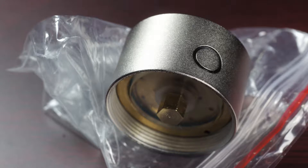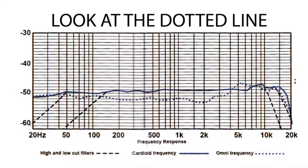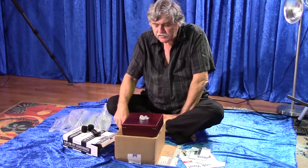This is an omnidirectional capsule. That's kind of interesting. When I first looked at the specs on this, I had a real WTF moment — because if you look at the frequency response, there is an extremely exaggerated treble, and I was wondering what on earth was going on. My first impulse was to think that it was poor engineering. But then I thought, no, these guys at Lauten Audio know what they're doing. After a tremendous amount of study and contemplation, I figured one of the most common uses of the omnidirectional microphone is for room micing, suspended microphones, things like that — and these tend to be diffuse field applications.